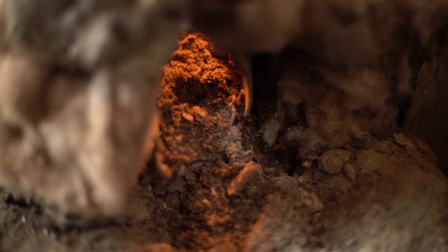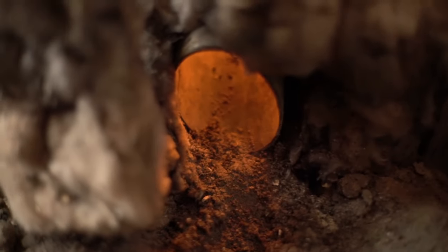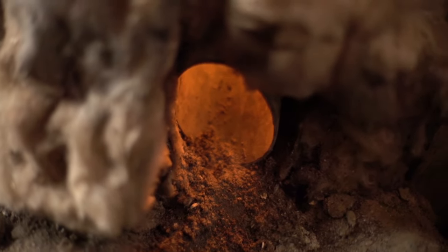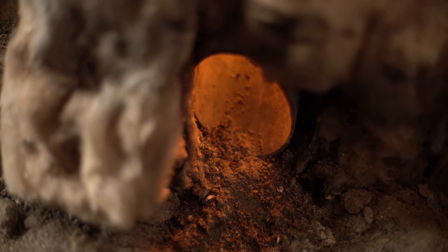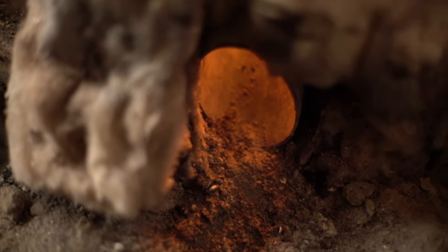It's January 2016 and I just wanted to give you guys an update on the Dragon. I'm just scraping out a little bit of ash from the intake. It turns out my design for the intake to inject the air up into the stack of wood was kind of fortuitous because I hadn't thought about the ash that could fall out of the stove as it builds up. But having it on roughly a 45-degree angle lets it basically self-clear.